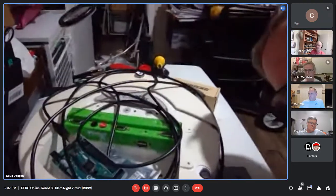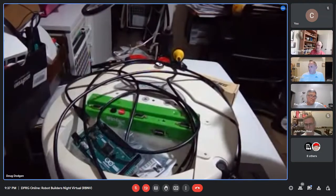Originally, they had an early Arduino. We always talk about a 328P, but before there were 328Ps, Arduino actually used a 168. And the Create had an option to buy a little block that had a 168 in it that it used to communicate. It was real nice. It had plugs, so you didn't have to make anything. You just used it. Pointing at that, I think that green thing that you had in here is what you're talking about. Could be. I think that's what I've heard about it. Okay, so that's a 168, so you already have something that's like an Arduino. Right. Probably 99% of Arduino code would work on that. Right, if you had the bootloader.